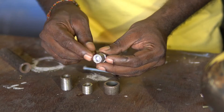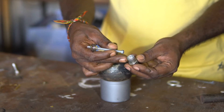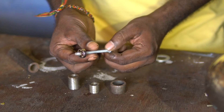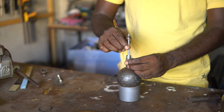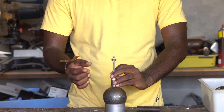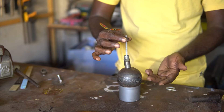Next we'll need a nut and a bolt — this nut will be welded onto the bush. I'll make three holes in the bush and weld the nut on top, and the bolt will act as a cover. I'm using an allen bolt because I'm going to weld a long bolt on top of it, and the allen socket makes it easier to find the center. We'll also need a ball bearing to hold the bolt in place, and two nuts to hold that bearing. This entire unit will be welded on the ball, suspended, with the flame applied at the bottom. In theory it should work — let's see how it goes.